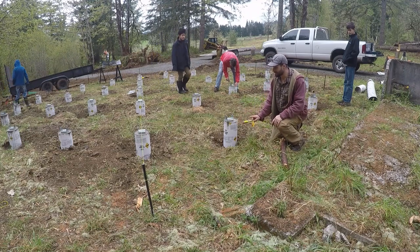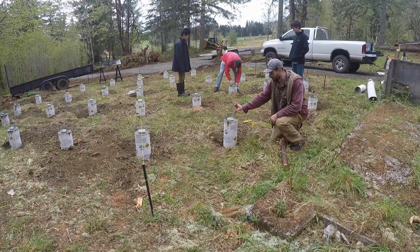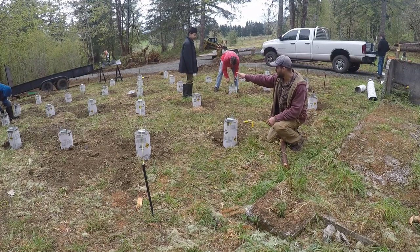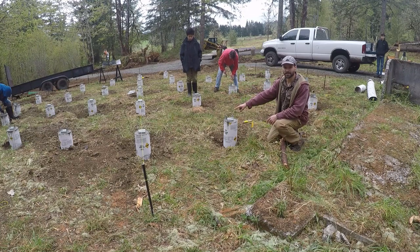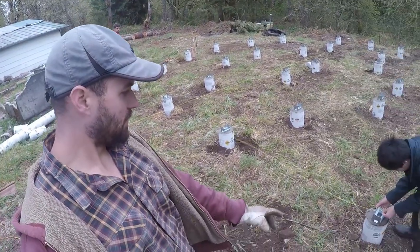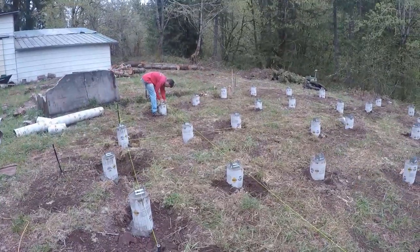Steven used the laser level and we determined that this is the highest point of all the footers at the exact location where it will receive the post. Garen and I talked through — we're going to have a minimum of an 18-inch clearance from our four by six cross beam as a crawl space under it. So this spot only needs a little six-inch four by four post here. Down at the low point, that post is 22 inches long versus the six-inch post over here — a 16-inch difference. Garen is running string along the edge of each bracket so that when he bolts them down, we've got a perfectly straight line to receive the cross beam.